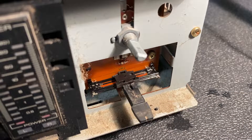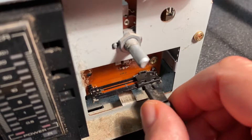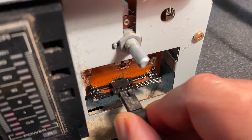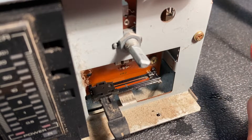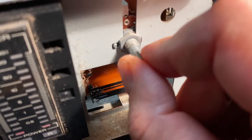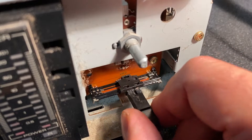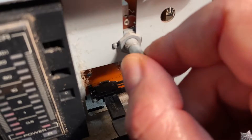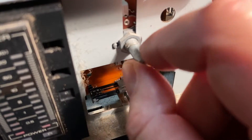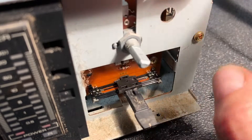Let's play some music and see if that helped. The unit's powered on with some speakers connected and music playing. The control seems to be far less intermittent now — I'm not getting any scratchy sound, that's a good sign. But still on the right channel we have diminished output. The balance control seems to be working fine now, but no matter what position I put it in, we're still getting diminished output on the right channel.